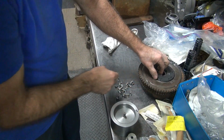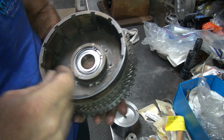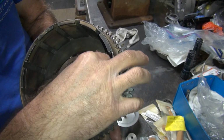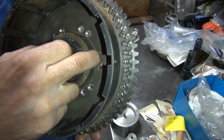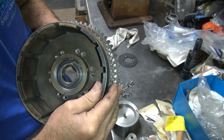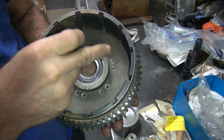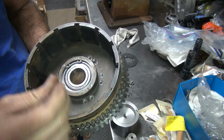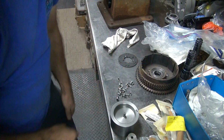Okay, this one here, you put the oversized rivet in it, depending on which hole you got here. Now I did re-countersink these deeper and to the correct angle, because they were not at the right angle for some reason. So basically they are just below the surface or flush, because they're larger diameter. So my rivet there sticks up 22 thou, as I recall. And the lowest one I measured in here was 15, so we should be alright. So most of these are flush or slightly above, so that's why we made it that way.